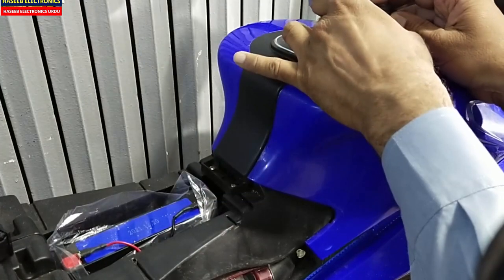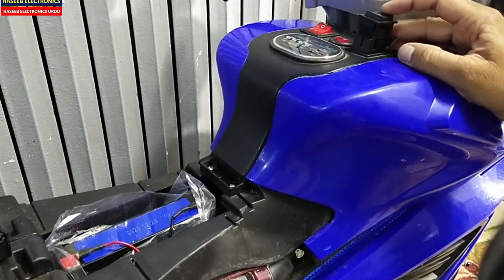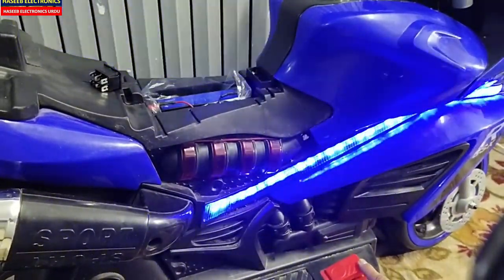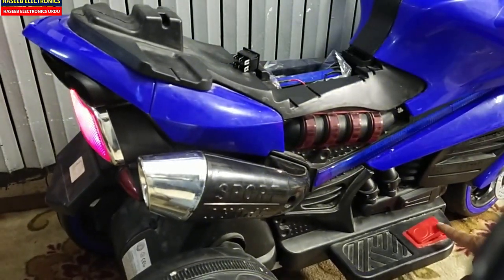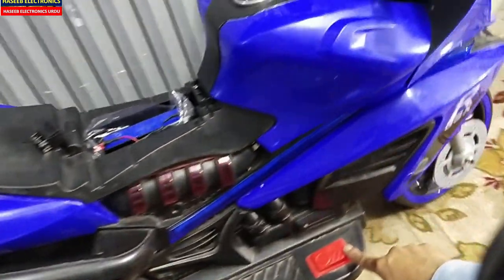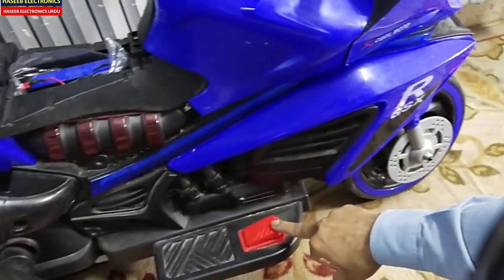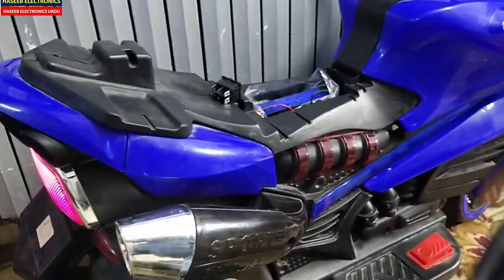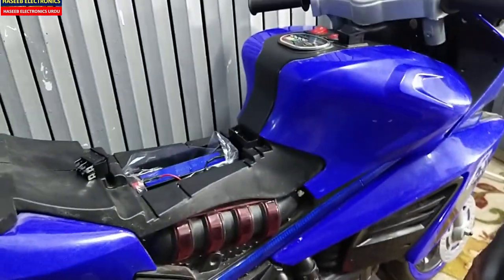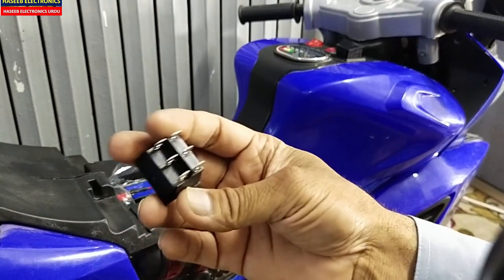It's okay. Now I will install this switch and then we will check. Now we will test it — I will turn on to the forward side. Oh wow, that's nice! Testing reverse and forward — pedal switch — it is moving, that's nice. Press this button — that's nice. So our problem is finished: this battery and this double pole double throw switch were both bad.